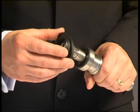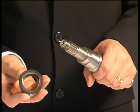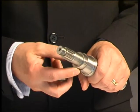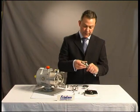We also have the rotary seal, which sits on a triangular chamfer on the shaft. There are no locking screws or grub screws, or any device to locate the seal on the shaft itself. It's locked into position by the chamfer, and it's very simple and easy to fit.